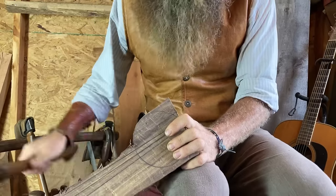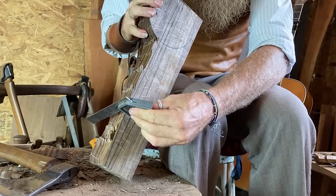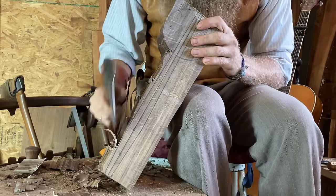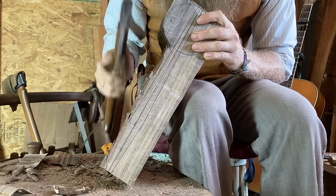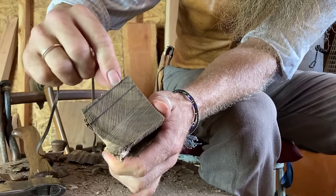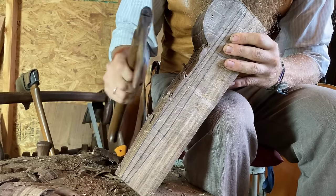I'm right down to my mark now. I'm imagining that I can see 90 degrees right here — if you're not good at seeing 90 degrees, get a square and check it. Stay 90 — that's really really important, and you want to cut right down that line. Let's see just how 90 I really am. It's a little wider back there than up here — no big deal, I'll true that up. That is another thing you have to practice while you're spoon carving: being honest with yourself.